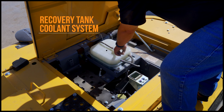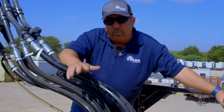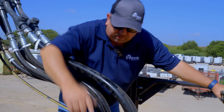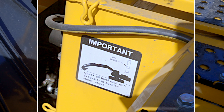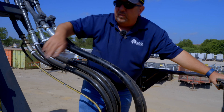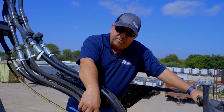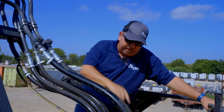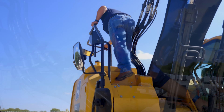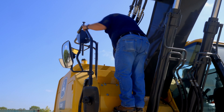Now we're going to open the engine compartment. We want to make sure the hood locks in the upward position — there's nothing worse than being down here grabbing onto the oil dipstick and having that thing come down on your head. The oil dipstick is located over here, the oil fill cap is located straight down, and we have our recovery tank for our coolant system located here as well. For the hydraulic tank sight gauge, there's a decal that shows the excavator with its boom and arm laid all the way out — you need to replicate that position to get an accurate reading. With the boom too far up in the air, it would not give you an accurate reading on the oil level.